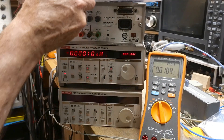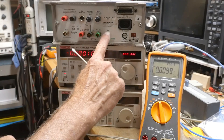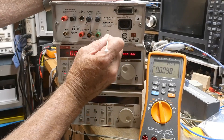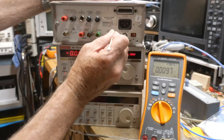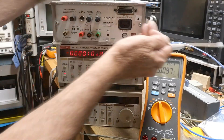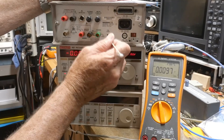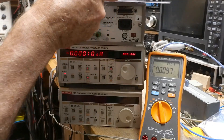I did print out the calibration routine. In order to calibrate this thing, you have to unlock it. So in the back there's this little hole — cal lock. You need something insulated and you can push in there. You can feel whether it's a click-in, click-out type of thing. Push it and it clicks in, push it again it comes out. When it's in, it's in calibration mode.